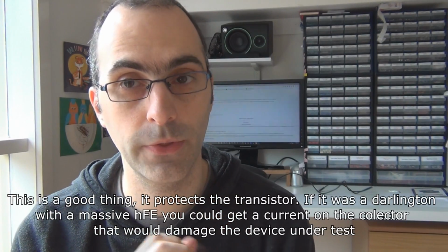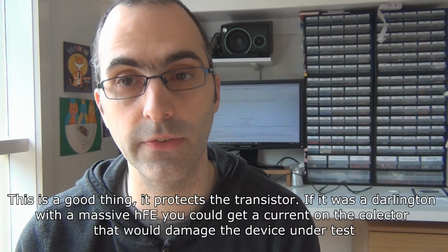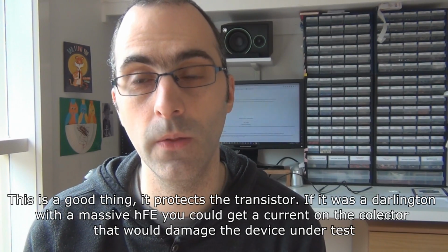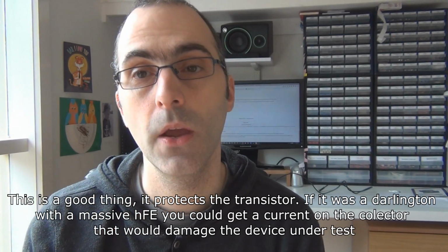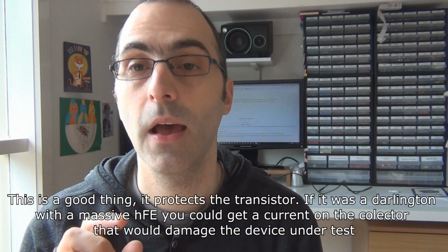With the Small Bear germanium transistor test, we know there's 9 microamp on the base. That's the known figure. With the DCA75, the known figure is the 5 milliamp on the collector. We don't know how much current is going into the base. It could be substantially more than 9 microamps, as with the Small Bear test. We just don't know. So you're getting a different HFE reading in a different situation. You don't know where on that curve the DCA is going to be testing.